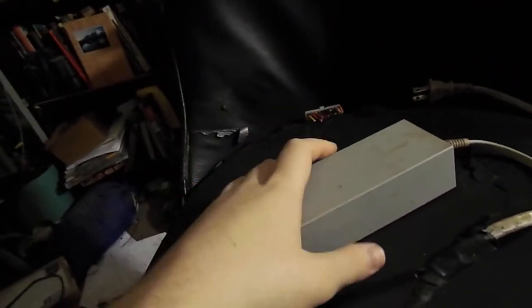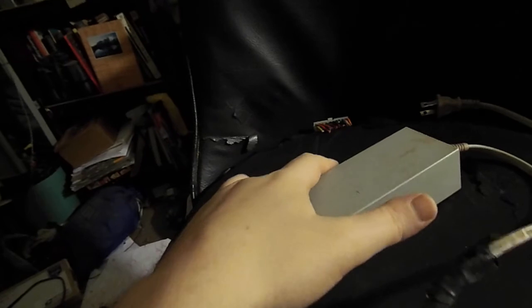You'll hook yourself up a nice little mobile CB in your bedroom like I did. I have a base station, but I also have a place for a mobile CB hookup. To get yourself an antenna, make a tape measure dipole or use some thin wire to make a vertical and put it on a door frame. I'm going to make a few videos on that as I continue on. But that's enough for today — this video's already gone too long, I've rambled on too much. This is Johnny Jones, I'm still at home. Bye-bye.